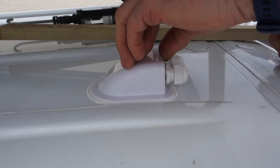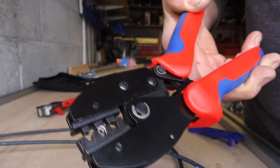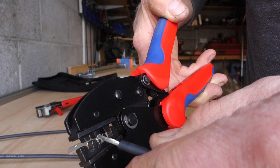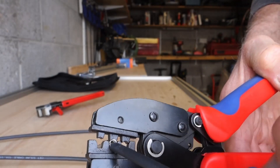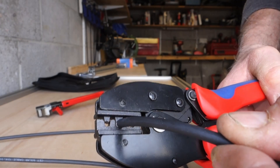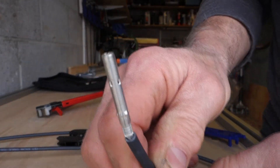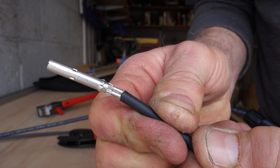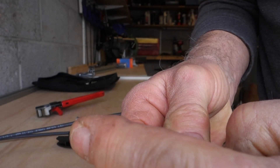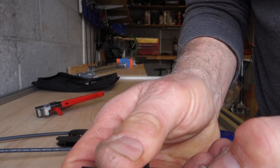That's correctly loaded and level — that's quite perfect. But I need to put the wire in. So the wire goes through, and I'll try and show you this as I crimp. You crimp it down all the way and release. You should end up with two spirals on a perfect crimp. This then pushes into here until you hear a click — like that.